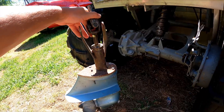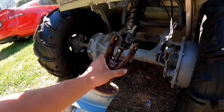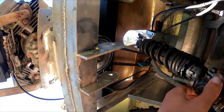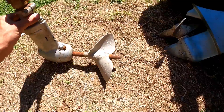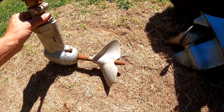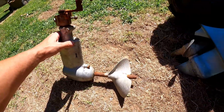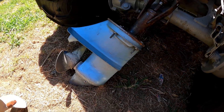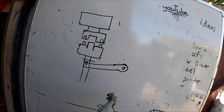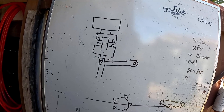This outboard lower with the universal — I sort of don't think it's going to work. The problem is I probably need two universal joints so that it will swing far enough out of the way. For those of you who haven't seen the other video, that end just screws into there and pivots off this piece. I also have this prop here which I'd like to use — it's a surface drive prop good for between 15 and 20 horsepower, so it would fly with this on. But it's a five-to-one drive off a seagull so that'll be way too slow. I could have a setup where it swings up and engages a dog onto the motor and just flips out of the way and disengages — tell me your thoughts on that.